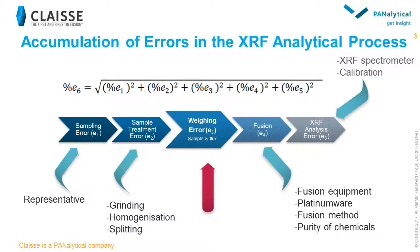But even with a perfect control of the sampling, fusion, and XRF analysis, the results will be affected by weighing errors. Weighing is often a neglected step in the sample preparation process. This study shows examples of the real impact of the weighing method on analytical results. By keeping all the other possible sources of errors constant, we isolated and tested the weighing process. We want you to be aware of the impact of the weighing process and how this step can be optimized. Minimizing the weighing errors will help you to enhance the quality of your XRF data.